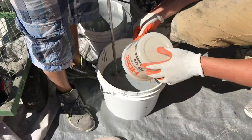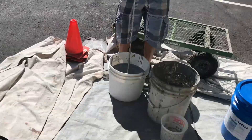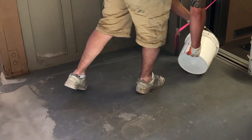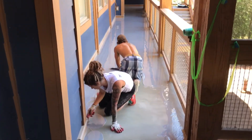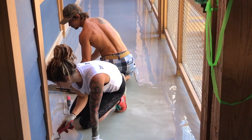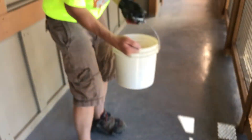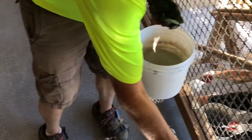At this point in the process, we have been involved on the project for about four days. Once the urethane is mixed up, there's about a 20-minute pot life before it flashes and gets hard, so there's some volatility working with the product and it has to be worked with quickly and as accurately as possible. We follow behind while it's still wet with the cleats to get out over the urethane, and then cast down what's called rubber granules to give it some texture and a non-slip surface profile so that it will be safe for public foot traffic.